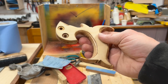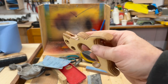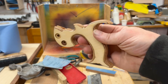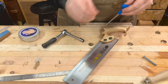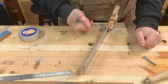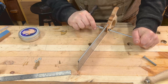That's what we're looking like — very very smooth. It went with 100 grit Mirka, then 220/240 grit Mirka, then two coats of boiled linseed oil, and after that a coat of Leo's from Handcraft. Let's get this on the saw. It's actually a number 10 Allen key. These are M6 bolts — the same size as number plate bolts. At some point I'll definitely purchase some proper saw handle screws and nuts.